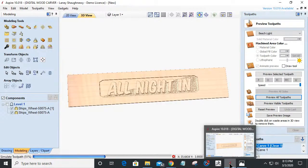And then we're going to do a V carve inlay method. Basically what we're going to be doing is using a V bit to create the female pocket, and then out of a contrasting piece of material, the male. And it's going to be done in stages. Once that female and male are cut, that's going to be glued in, inlaid, and then it's going to be milled off and kind of flushed up, if you will.